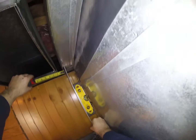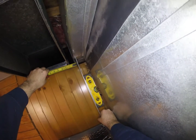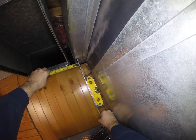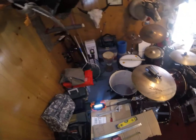And then I'm going to measure right to my S-cleat, which this S-cleat's going to bend out just a little bit more. It's good to have a magnetic tip there on your tape measure to help you move it all around, but basically we're looking at 2 1/4. I would say 2 1/4 is going to work out good. So that distance, 2.25. All right, now we got all the information we need.